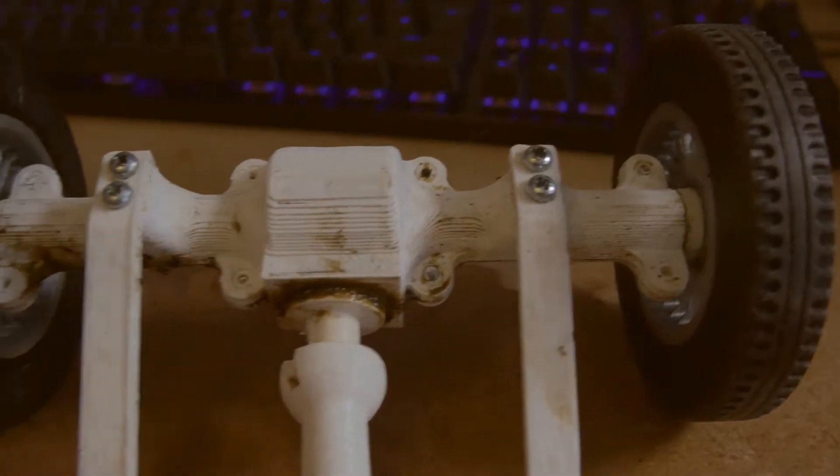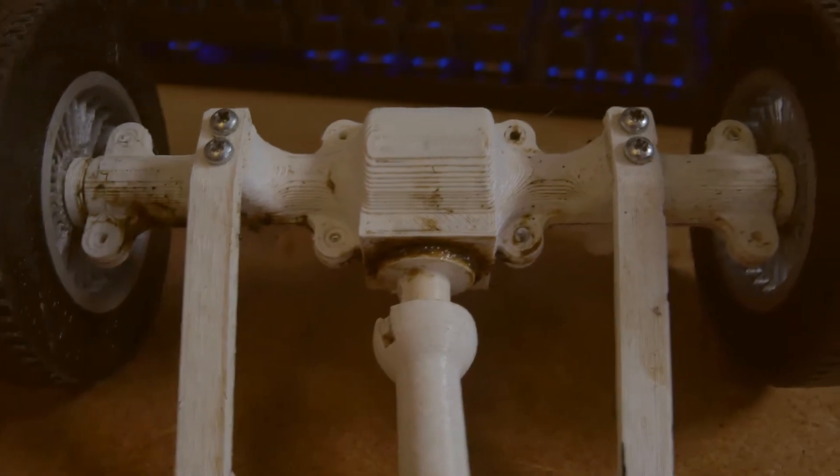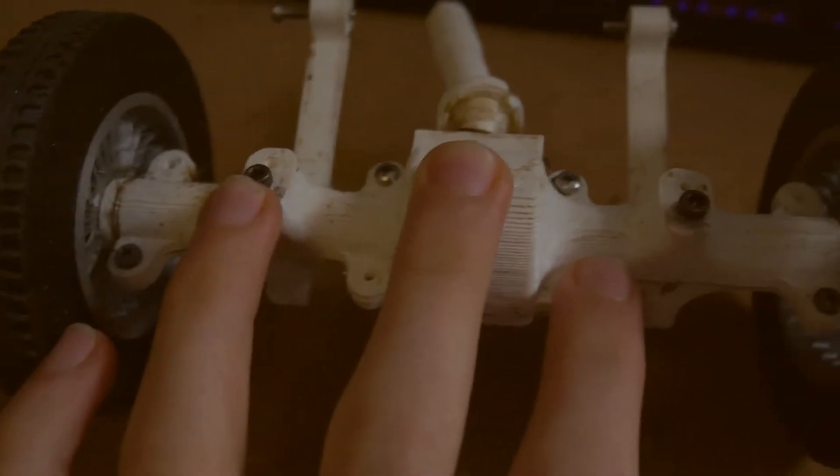This has a ratio — I think it's about 8 to 14 or something, so it's almost a 2 to 1 reduction. It's got some small bolts in it so it's quite thin and is slightly flexible. On this bolt here and this bolt here, that's where the rear coil springs mount. So it hasn't got any shock absorbers, just coil springs, which will be something that changes.